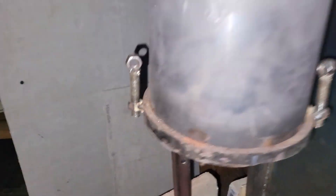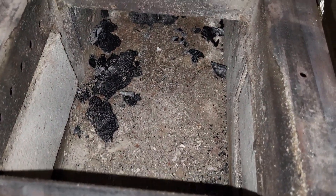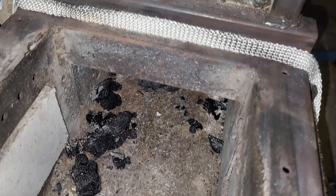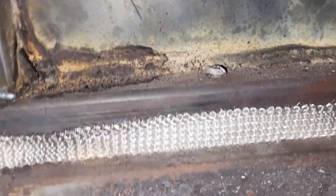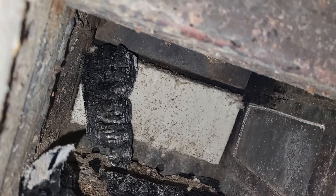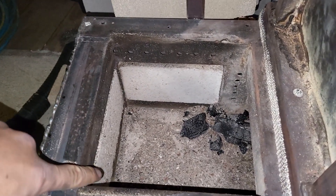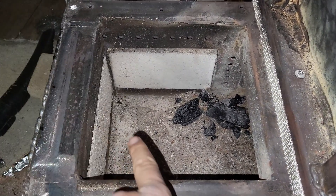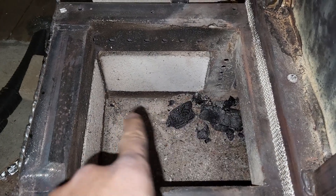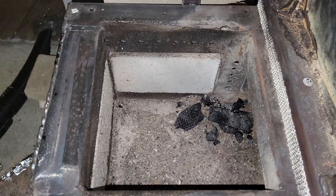Here are the changes — this used to be just a ceramic wool floor. Now there's two-inch ceramic fiberboard, plus I replaced the fire bricks with ceramic fiberboard down there as well in the primary burn area. Now we're going to add another piece of ceramic fiberboard here and one across there.